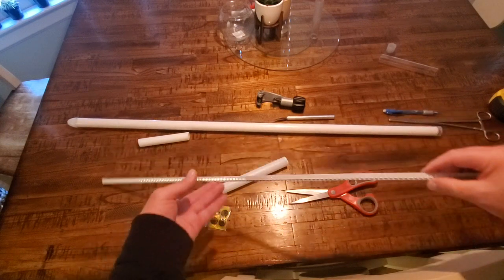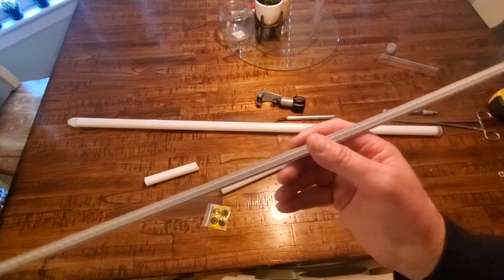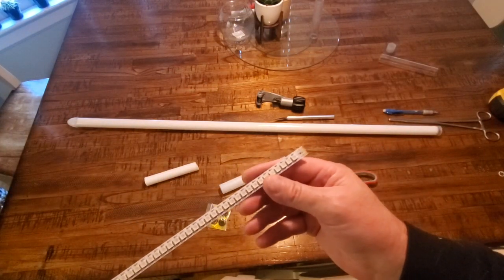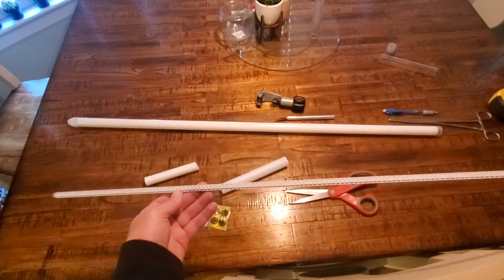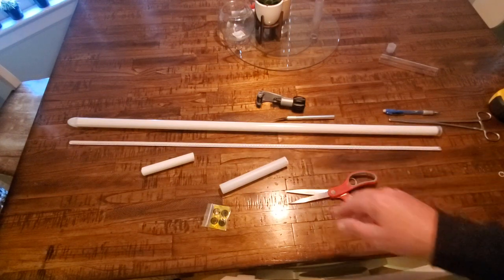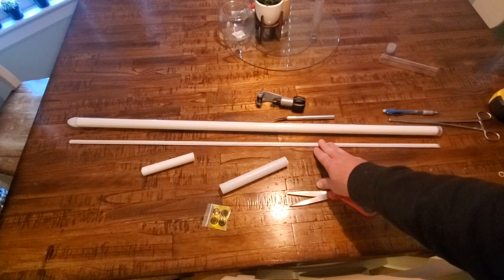So all that's left is to wire the strips. You can see this process is much simpler and quicker than my last video when we were building a Neopixel blade from scratch. Now, my scratch built Neopixel blades are still very awesome, but they're a lot more work than these KR blades are, and they're a lot more durable than the KR blades are. These PCBs are solid. They're not as flexible as the strips. So they're going to be prone to more breakage if you're dueling with them. So these aren't really suggested for dueling.